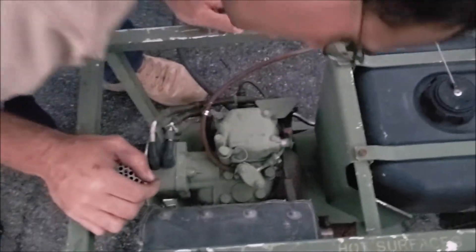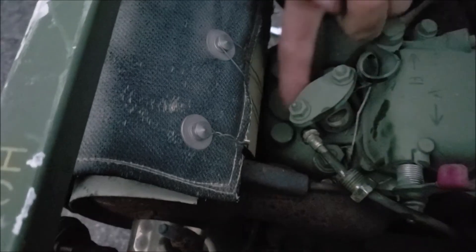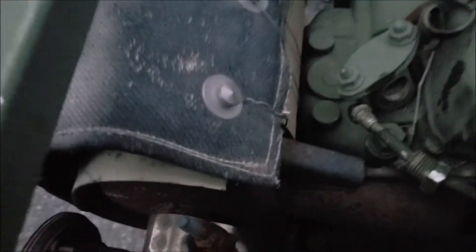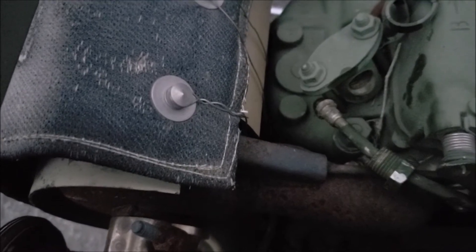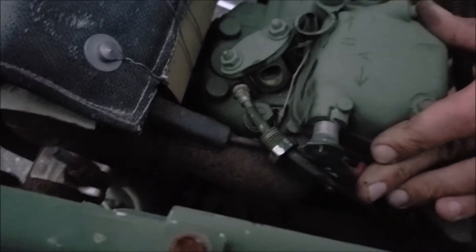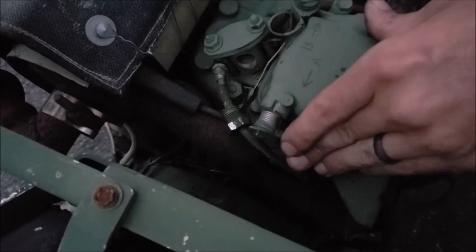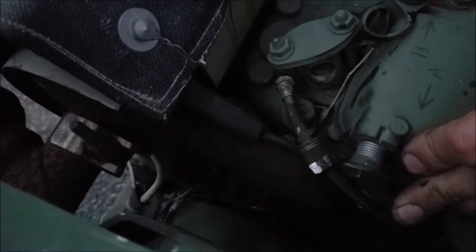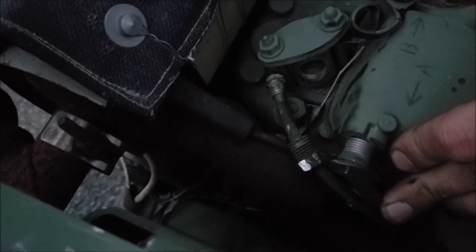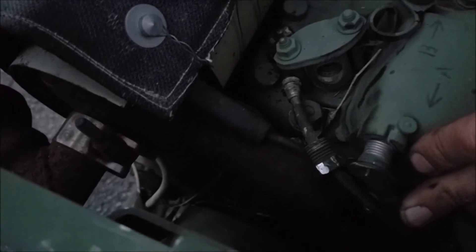Usually there'll be something coming out by now unless the seal didn't break enough. I've got the bolt out of the injector and it's pointed to the side, so if fuel is going to come out you'll see it start to spurt. Troubleshooting some more - the little valve underneath the tank wasn't feeding, so I think that's why we weren't getting any fuel up there. Now that we know for sure there's fuel going to the injection pump - there she goes! All those little air bubbles - yeah!